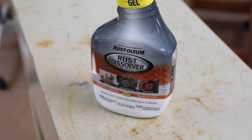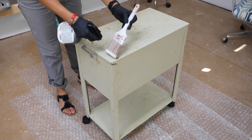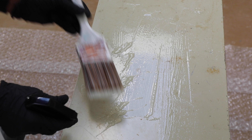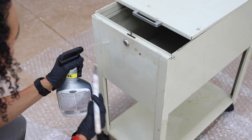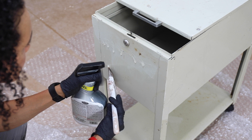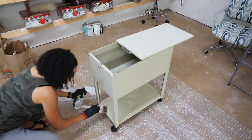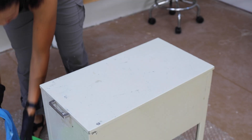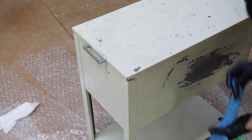The next step was to remove the rust. It had not a lot of rust, but enough to where I just wanted to coat it, get it nice and clean, and prepare the surface for paint. This is a rust remover that you just spray on, use a brush, and completely coat it. You don't want to leave it on for more than five to ten minutes, depending on how much rust you have. The instructions said do not let this dry, so keep working it into the surface and reapplying it. Once it's had about five or ten minutes to work, remove it with fresh clean water — because if you let it dry on metal, it will remove the finish.